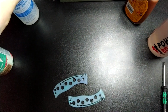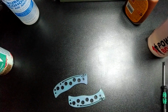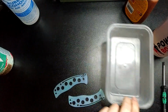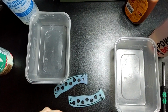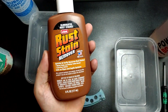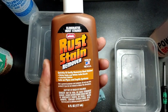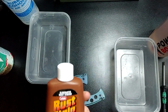After that, what we'll be doing is stripping the old anodization off. So you'll want, actually, that's the other one. You want a Chinese takeaway tub or similar, any kind of tub. And you need to get some of this. You have to get some form of acid, like hydrofluoric acid, which is the only one I know that works. You can get specific acid for doing this.